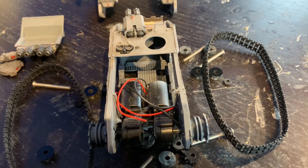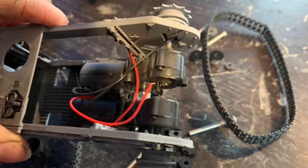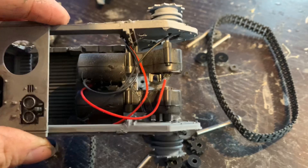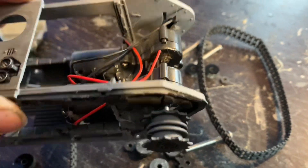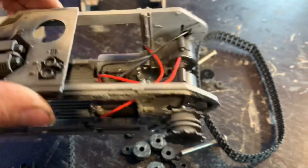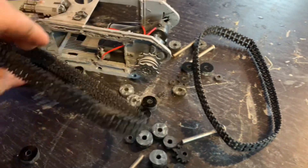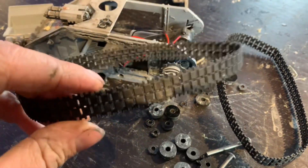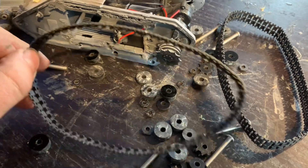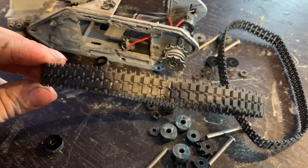With the top of the model off you can now see the gearbox mounted in the back. I basically cut this out of a cheap kit I found on eBay — I'll link it in the description if I can still find it. This is good because you've got the sprockets with it all attached, so you have wires attached as well. Crucially, if you're ever making any radio controlled tracked vehicle, you need to make sure you can actually get tracks for it. I picked this kit because it would be roughly the right size for a Land Raider, particularly track-wise.